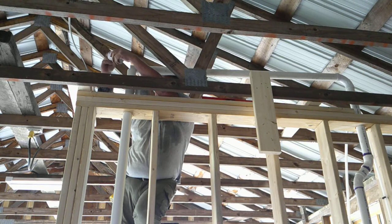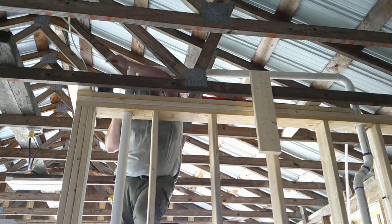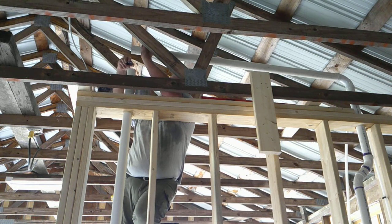You have to have a primer. The only difference with purple primer is that the inspector or code enforcement officer will be able to look at it and see if there's purple on it and know it's been primed. That's the only difference — it all works the same. Purple just makes a bigger mess, that's the bad part about it.